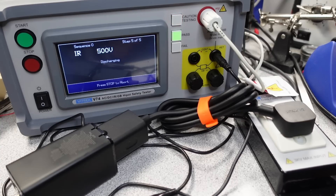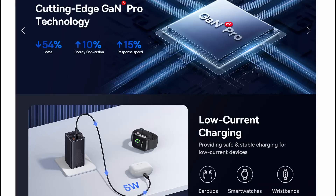The results of this testing show that this adapter was acceptable on 120 volts, but if you plan to use this on 240 volts, it will leave you tingling. It has good isolation but is well capacitively coupled. If you have some suggestions for tests to run, let me know - this is far from comprehensive. Just a quick check of the performance, and this one doesn't win any awards. I set my threshold of acceptable at 250 microamps, though that might be too low since a lot of devices cannot meet this. The marketing had a few percentages in it: 54% less mass, 10% better energy conversion, and 15% better response speed.